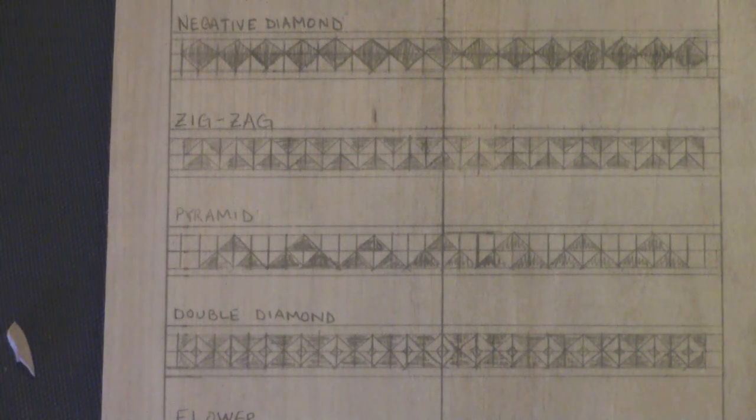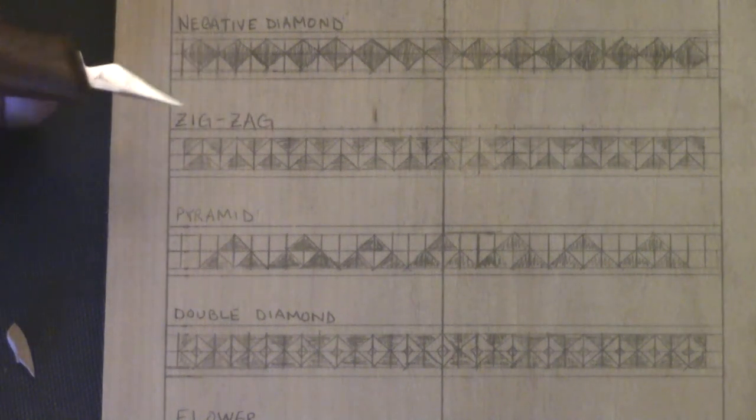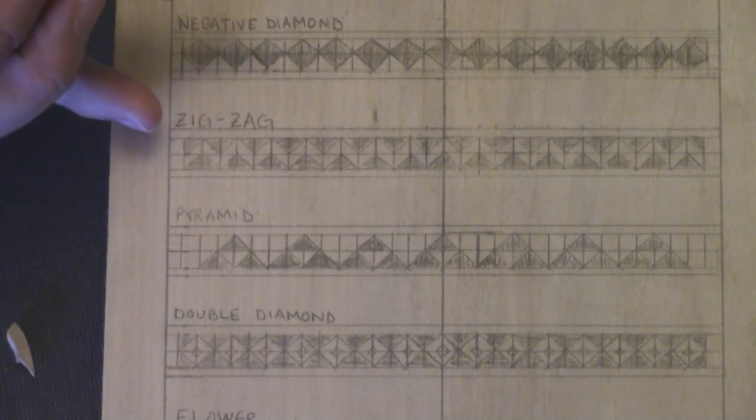On this example, I laid out 4 millimeter blocks to do the triangle chips. You can do a lot of very beautiful borders with a simple triangle chip. I start by angling my knife 65 degrees and applying more pressure as I move across the line, tapering out by the time I reach the end of the line.